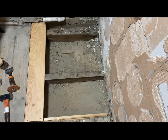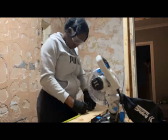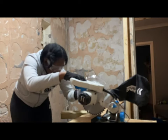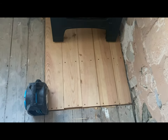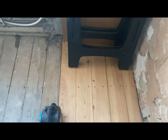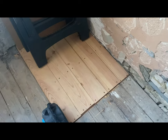Floorboards are a bit of a puzzle, so make sure you cut all your pieces first, clip them together to see how they fit, before you screw them to the beams. We made our measurements and double-checked them to ensure we didn't cut the wrong pieces. The final result was really sturdy — me and my husband could stand on it without it breaking, which is great. Thank you so much for watching this video. Make sure you subscribe to my channel and like this video — more content coming soon.